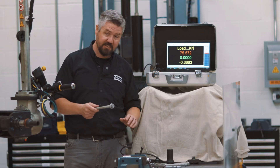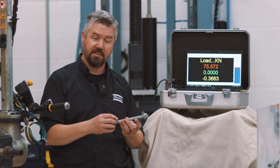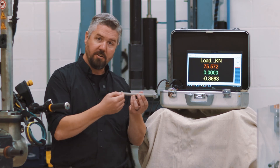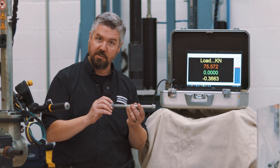What does that mean for this setup? I have an ideal setup here where everything is aligned and the pieces are already drawn together. In this case I could really choose either — tightening from the head side or the nut side — and the difference in these two results is telling me that the friction is different from the under-head surface turning against the part versus the face of the nut turning against the part.